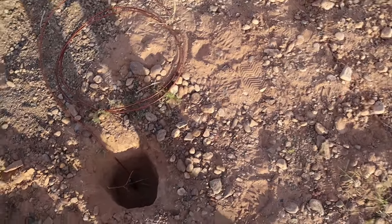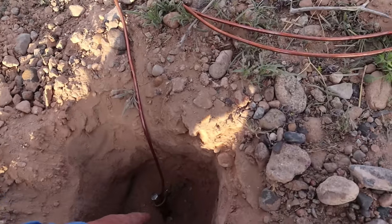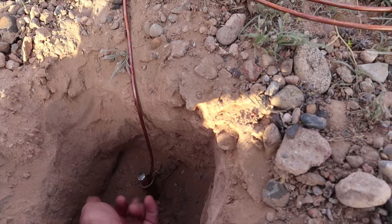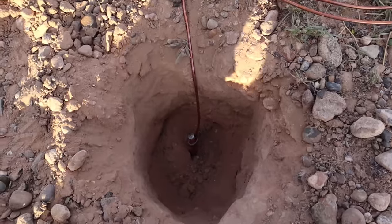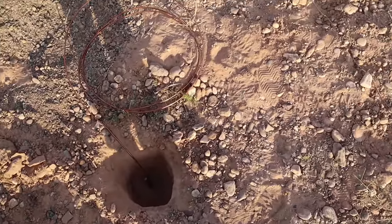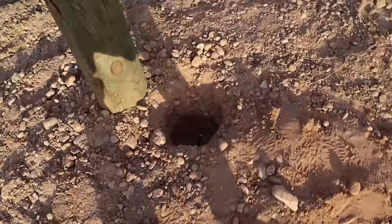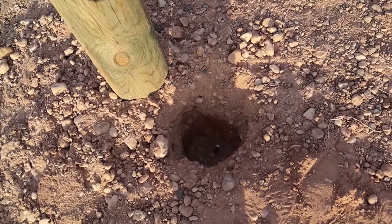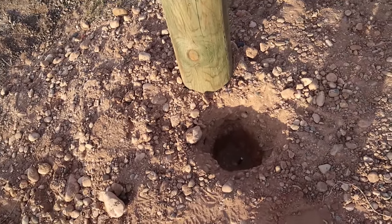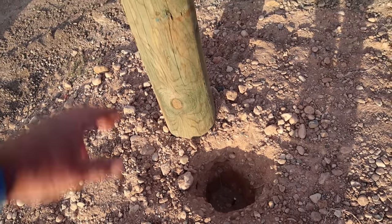The copper wire is clamped on — you'll notice this clamp here. I have to flip it over; the wire actually has to come in from the bottom of the clamp, not the top, so we have to adjust that. We have two ground rods that are 8 feet apart. I'm going to cut a trench across here to the next ground rod, put the clamp in — notice the top of these ground rods are 1 foot below grade. Then we come up the pole through the EMT into the bottom of the box.